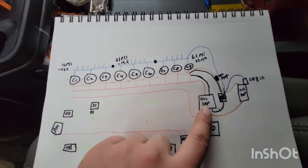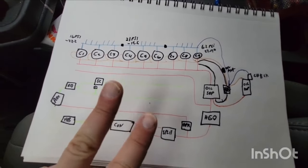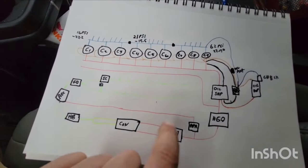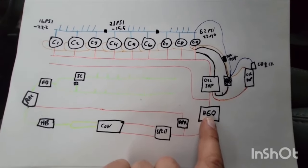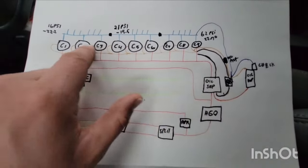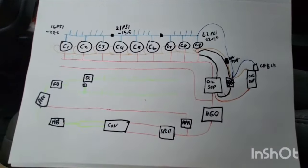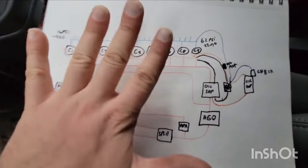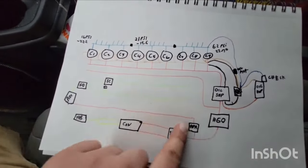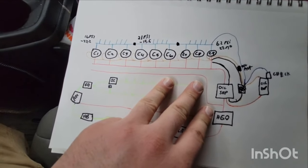So obviously for the high discharge, you have cleaning the condenser and checking the condenser fans. Those are your two 90% issues, okay? I've also had it where the hot gas differential valve was stuck, causing the discharge from the back part of the hot gas valve to increase to the point where it would trip on high discharge, right? So if all your normal things check out, are all your ball valves open? Is your condenser clean? Are all your condenser fans running, right?